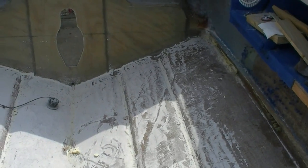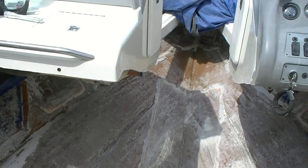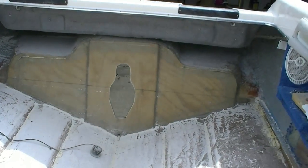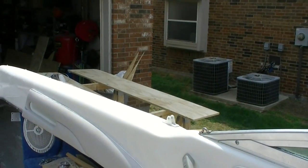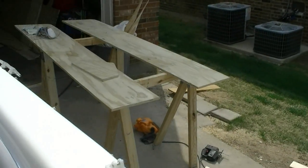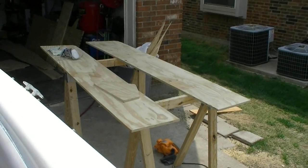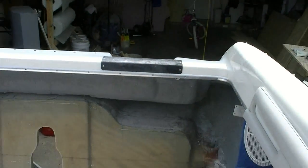I'm going to start putting resin on them and encasing them in 1.5 CSM. But right now I'm going to sweep this out and wash it out really good, let it dry, raise the nose up, and cover it — get ready for this rainstorm so it doesn't soak my new transom. So I think that's it for this weekend until I start doing the waterproofing, which I'll videotape later and show you how I do it. Remember I left the stringers taller — we're going to bed them down, let them set up, and then cut them to height so we can have it exactly right.